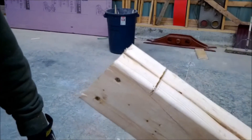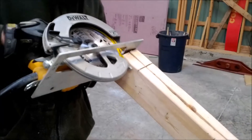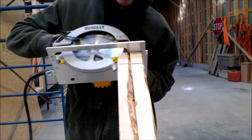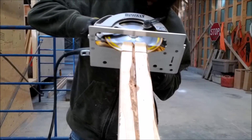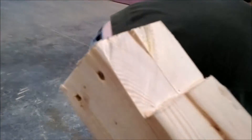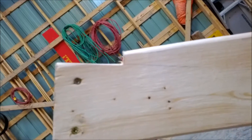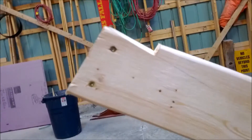We're going to cut the heel of the bird's mouth notch on the rafter right now. We've got the saw set at 10 degrees, and we've also got the depth of the saw set so that it won't go any deeper than what's required for our notch. Tim is going to make the cut down. The seat will stand up from that end to the corner. You can see the line we've drawn — that will form the seat of the bird's mouth and come right into the heel we've already cut with the chop saw. Tim is going to use the circular saw, also known as a skill saw, to cut the seat. You can see now that's a right angle cut into our rafter, notched in so it'll seat flush on the top plate of our higher wall.